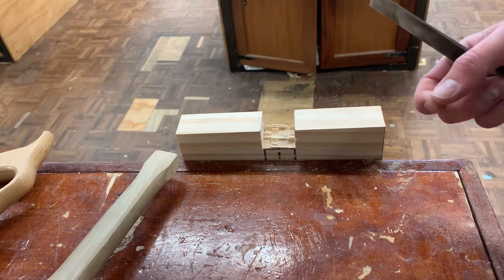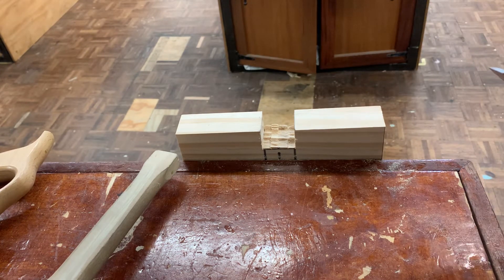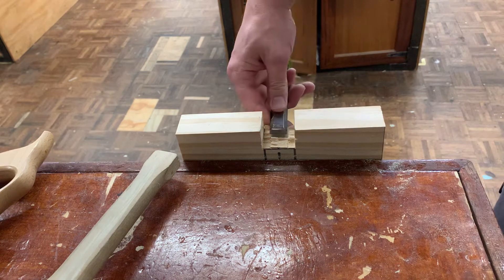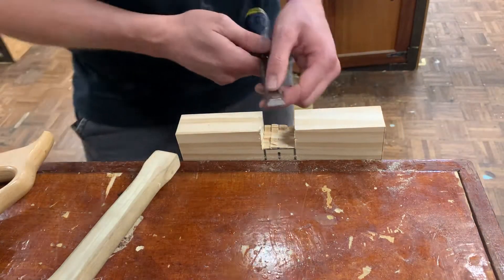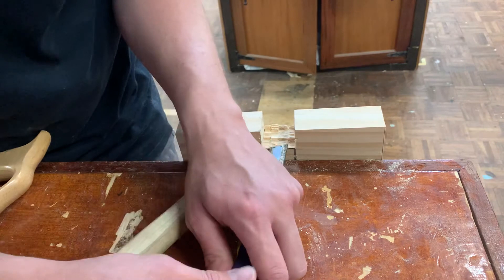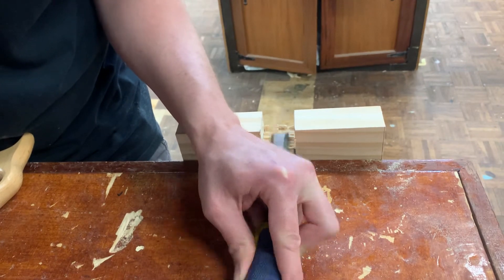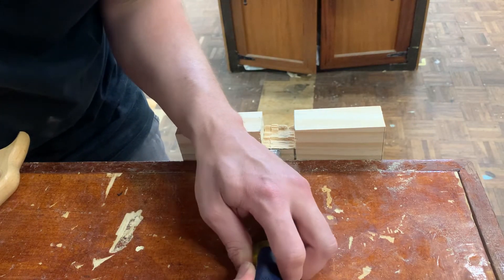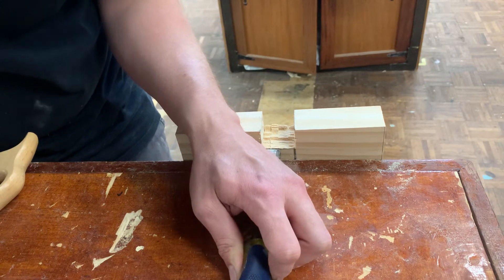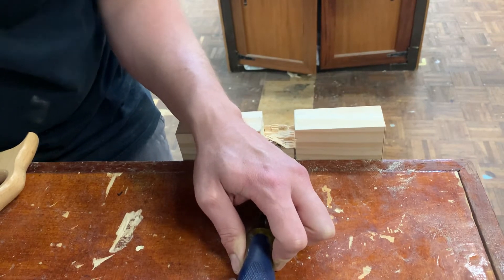If you go through the whole way you're going to find that it's going to chip out and be really ugly. If you chip out the edge, that's ten minutes of tension — just be aware of that. Step one is go halfway to the center and then go halfway back. Normally I'd always chisel away from me, but for the sake of the video I'm going to start a little bit above where that line is and just remove all excess material down to that line. I'm taking my time, not taking huge cuts — about a millimeter at a time with very light taps.